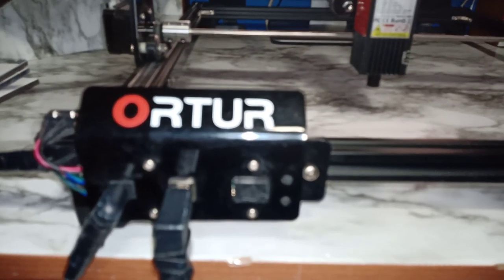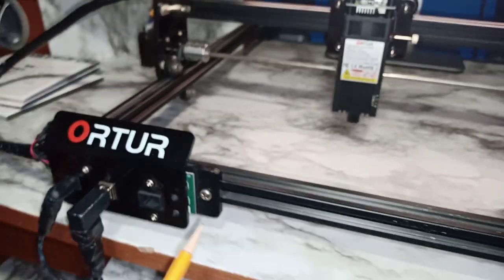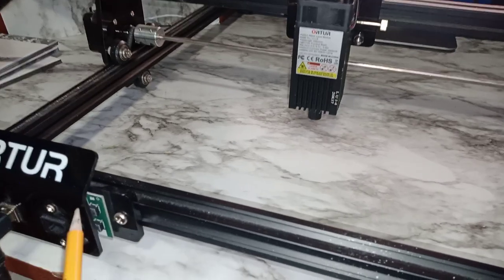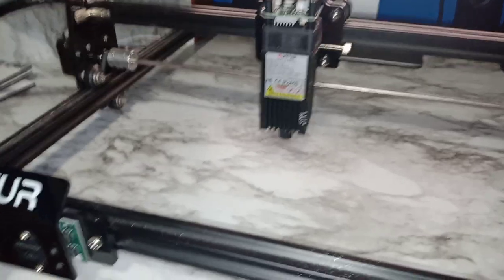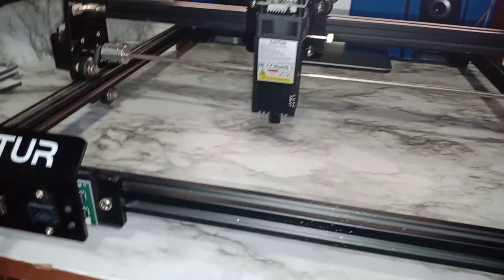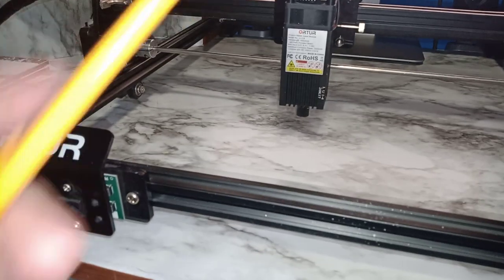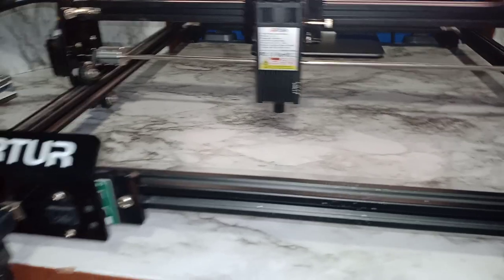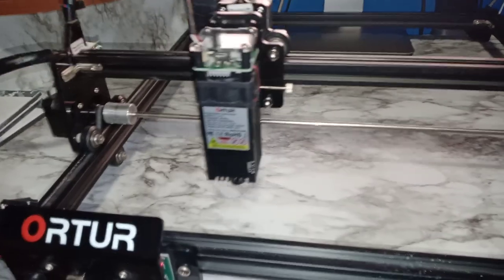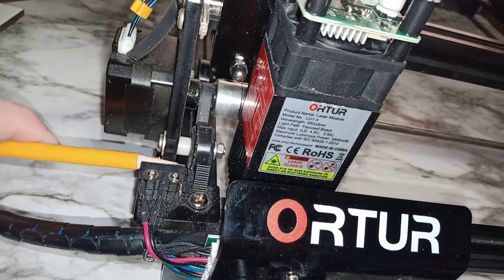This is your xTool motherboard. This is the reset button and this is the power button. The idea of the reset button is if something went wrong — the machine got stuck, you messed something up — and you end up with a purple light blinking, just hold the reset button and it should take everything back to the original setting. Then you home it. The power button: if your power supply keeps turning off and back on, you need to make sure to power on your machine first.